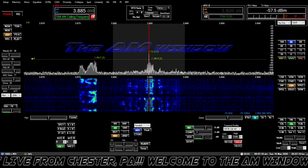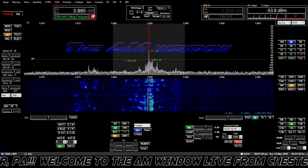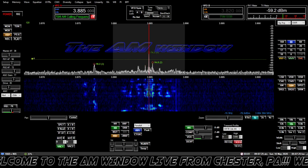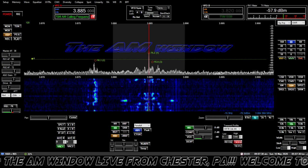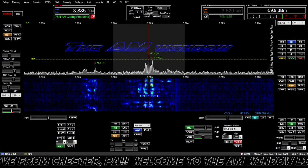But you know, I've got a Yagi up, and the Yagi is only resonant in one part of the band, and that's it. You've got a 4 megahertz swath there, and with a regular standard Yagi you can't tune that entire swath. But apparently these Dominator 6-meter verticals will tune that full stretch. So anyway, I got one on order, and we'll see if it comes in.